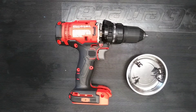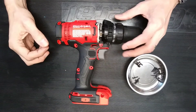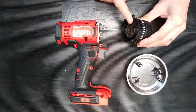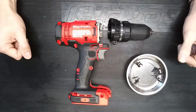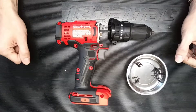Okay, we're back — we got the tool taken apart. The first thing I wanted to mention is I noticed there are three different types of screws holding the housing together. You've got screws that hold the housing halves together, screws that go into the front here that hold this outer gearbox onto the motor assembly, and then screws that hold the internal gearbox to the outer gearbox. So three different types of screws — something I don't typically like to see during the manufacturing process, as it opens up opportunities for whoever is assembling the tool to put the wrong screw in place.